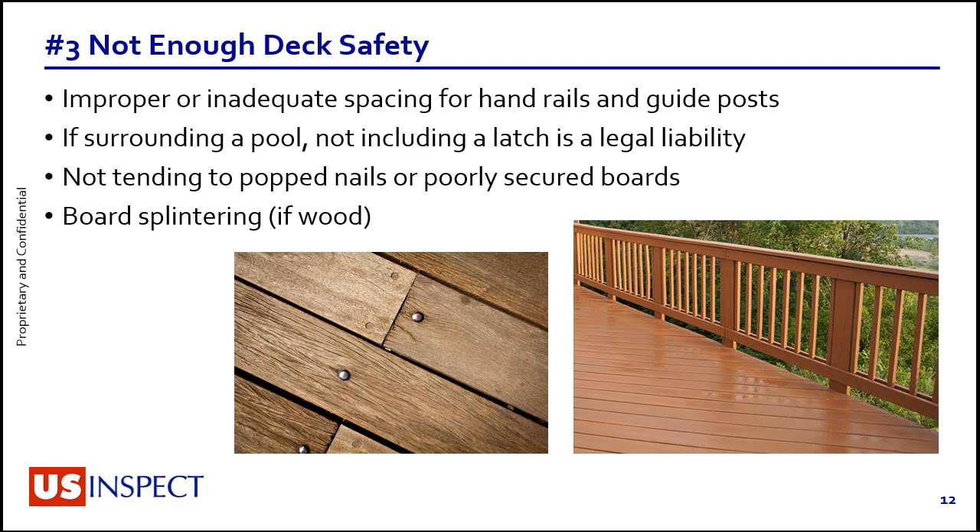With deck safety comes the deck boards themselves. We always check to make sure the boards are as solid as they can be and that the fasteners are in place — you can see nail heads in the picture on the left. You'll occasionally see us dragging our feet; it's not laziness — we're checking for floor height level and for nails that have popped up, which can be a trip hazard or injury hazard if someone falls on them or is barefoot. If the boards are heavily splintered, that's something to look for as well — you don't want a deck that's difficult to access just because someone pressure washed it too closely.